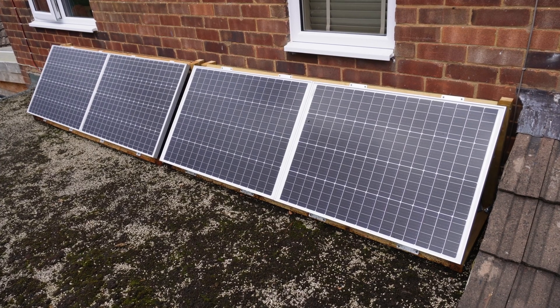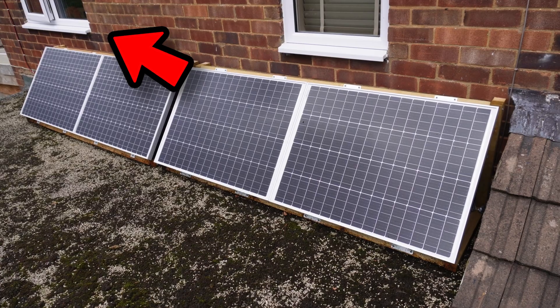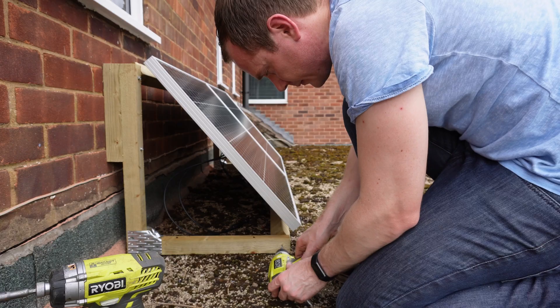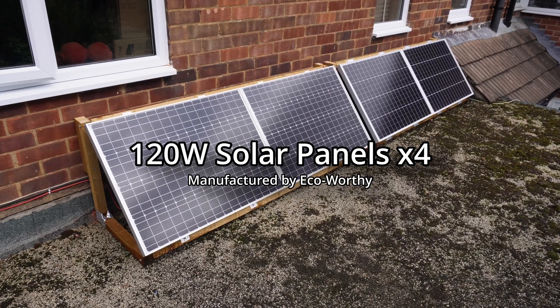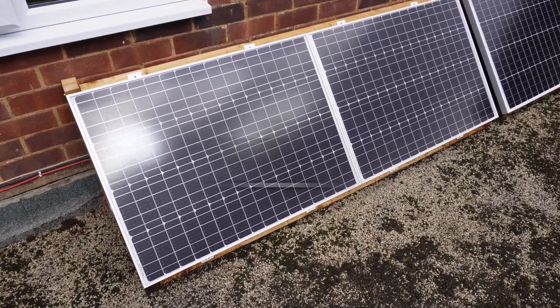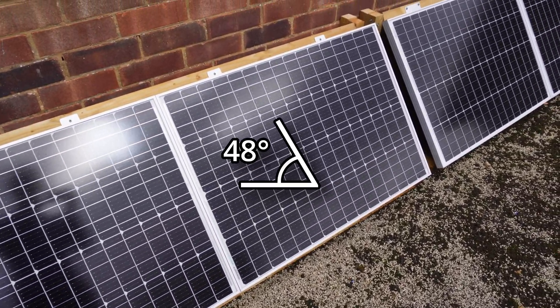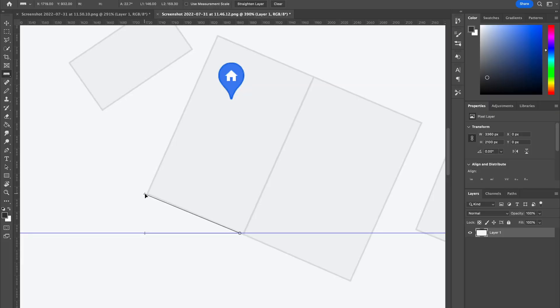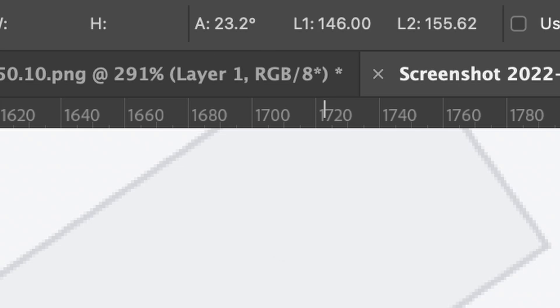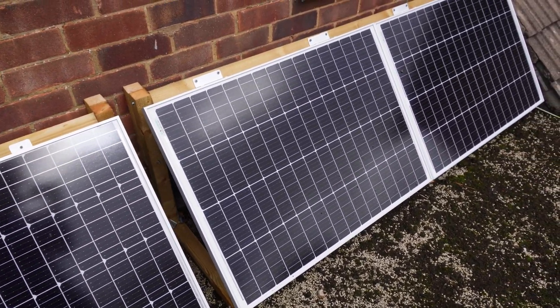Let's start at the panels themselves. The window to the room you just saw is just there, and out on this flat roof on some basic wooden frames that I put together and anchored to the wall, I have 480 watts worth of solar panels made by a company called Ecoworthy. These panels are angled at 48 degrees — I was actually aiming for 52.5 which is my latitude here, but it's close enough. The back wall of the house is south-west facing at an angle of only 23 degrees off of due south, which would be the ideal. It turns out they work great in this spot; I've seen a peak of over 390 watts back in August.